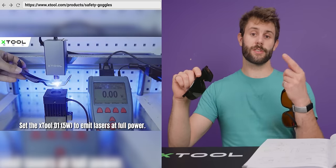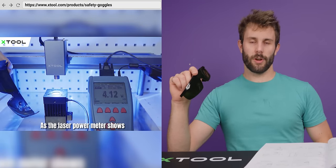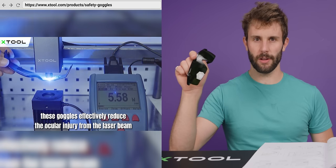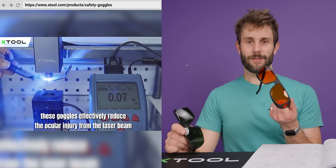When you're blocking out a blue laser, generally orange is the lack of blue, so it'll absorb all of that radiation. Whereas with the green ones, I'm a lot less certain. I did watch a video of them demoing the safety glasses working properly, where they blasted a laser straight through it into a power meter, though the amount of reduction in power wasn't really high enough for me to be content with using something like these. These are expensive, but you only have two eyes, so we're gonna wear them.